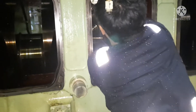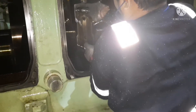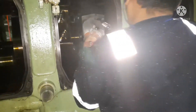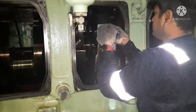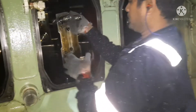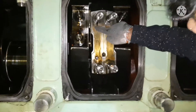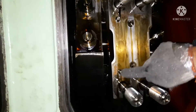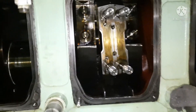After removing the nut, you can just pull out one half of the crank pin slowly. It will be a little heavy, so always try to take it out with two persons. Ensure when you are taking it out that the thread should not hit the crank pin. You can check — this is your lube oil hole, and those are your aligning holes.